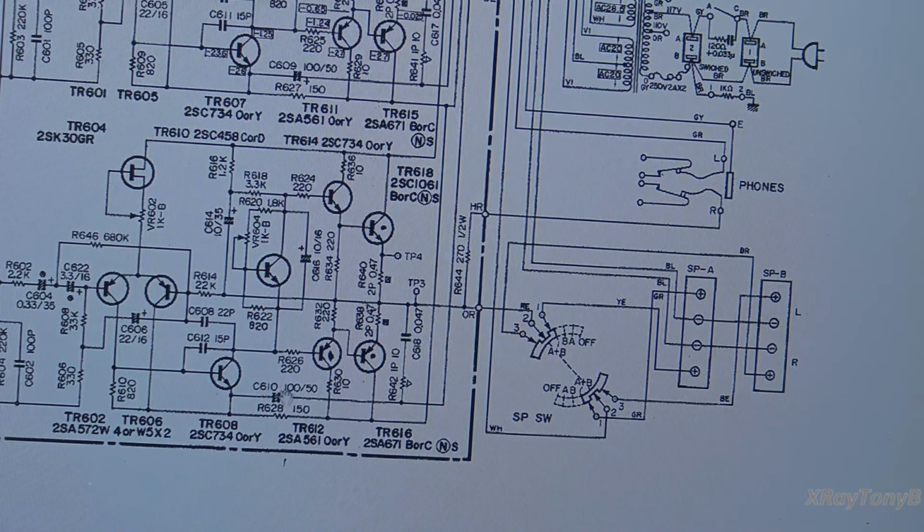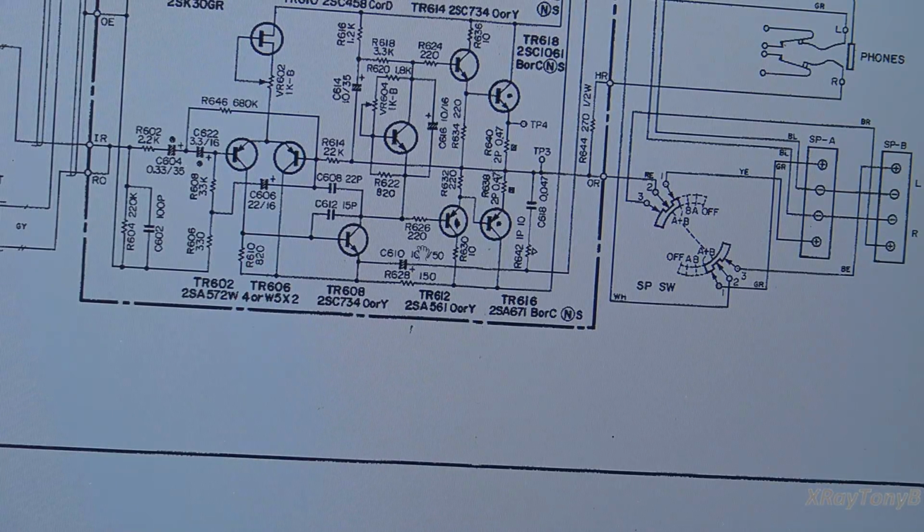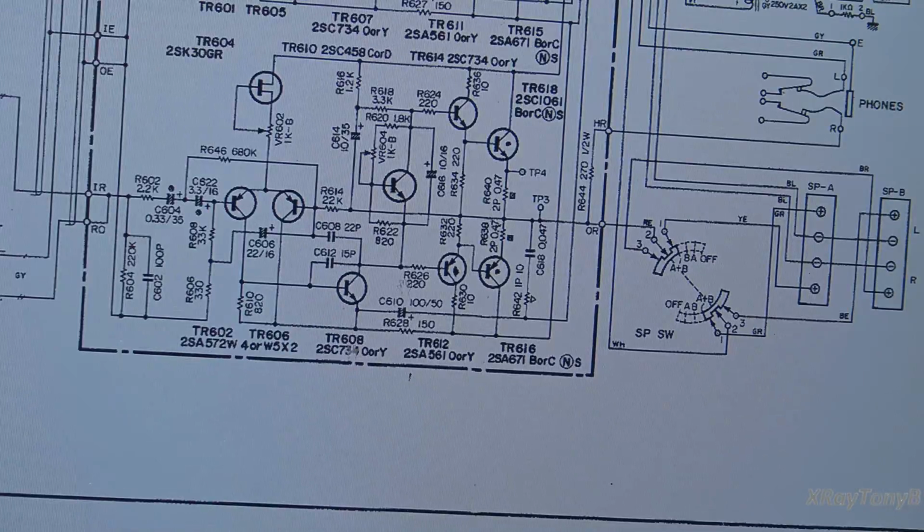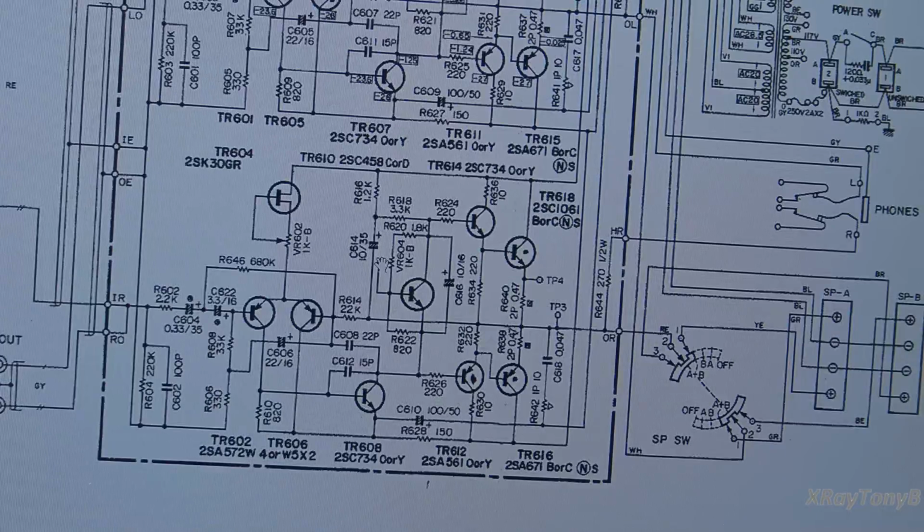Okay, and looking at that right here, see it? That goes straight over to here, and if you follow the wire up, straight up here, this outer wire goes to that center tap of the transformer right there. And if you look at the other end of the capacitor, it's connected to your rail voltage, right here it says negative 23.6 volts. Or I'm sorry, negative 26 volts. See it right there, 26 negative.